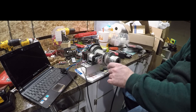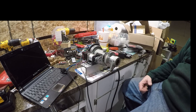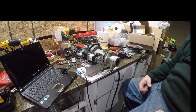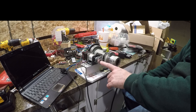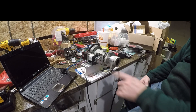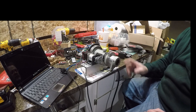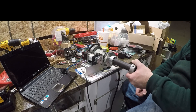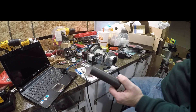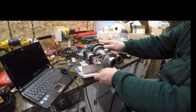This is the 20-tooth sprocket. The vendor is StepperOnline — I am not related to them in any way, not buying, not selling — straight from Amazon. It had a 6mm shaft and I had to bore it to 8mm, and then this larger sprocket I had to bore as well. This is your standard tightening for your 5C.